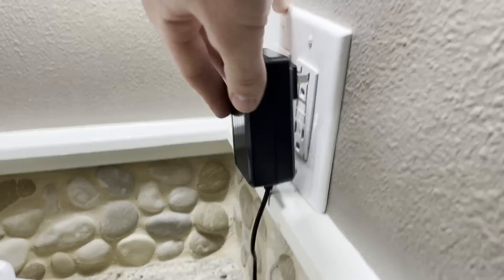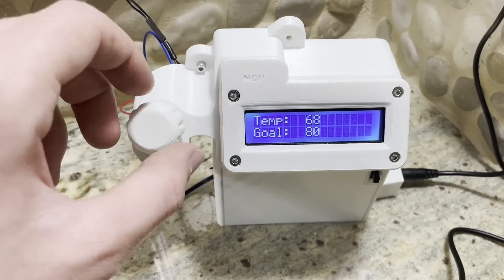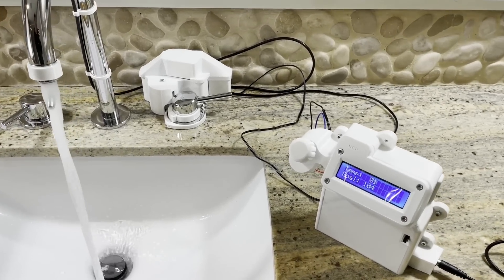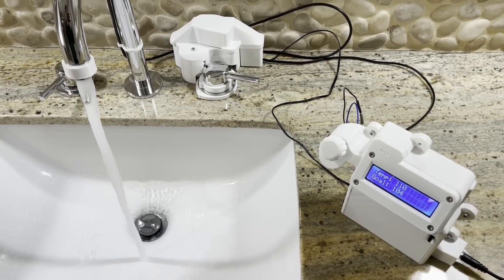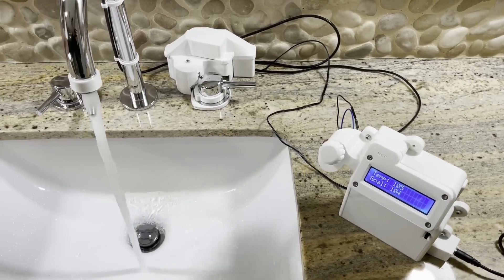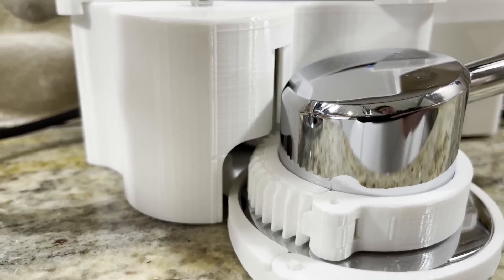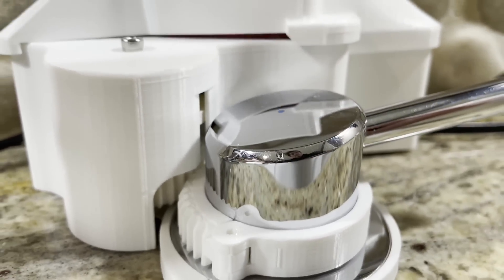The last thing to do is to turn it on and set the goal temperature. When I turn on the hot water, the temperature reading goes up, so the system turns on the cold water to compensate. Then when I turn the hot water off, the temperature drops, and it turns off the cold tap. I need to do a bit more fine-tuning, but it works pretty well. A nice feature is that the cold tap moves freely when it's not being used. Here you can see how the intermediate gear engages only when the system needs to adjust the cold tap. That's how I designed and built a PID water temperature controller. Thanks for watching.